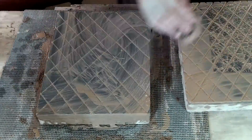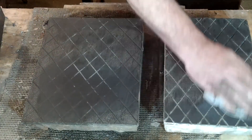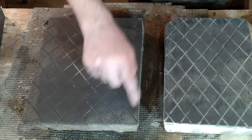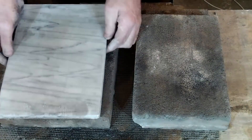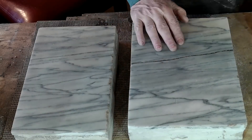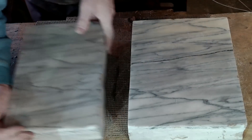I want to reiterate that these two plates are not surface plates — they're going to be my lapping plates for small parts only, and I'm using them to show you how I made my surface plate. The floor tile side of the process has now been roughed out and I'll now attach the two marble plates using tile adhesive mixed as per the package instructions. This part of the process is the same process I used for attaching the granite worktops to the slab on my surface plate.